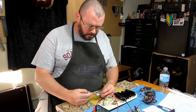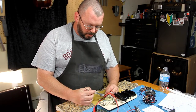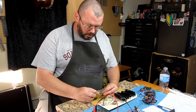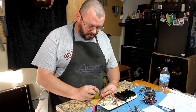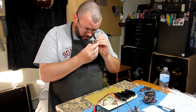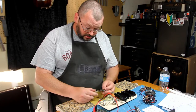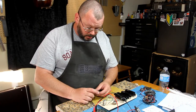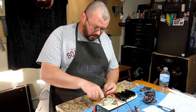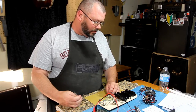Number one, I have got a bridge that basically goes from the pot and then the two middle lugs on the coil tap part, that I have to connect those three points. And then I have this little tiny, looks like a 23K resistor, and I've got to get that again between the casing and this far left lug, so I'm going to move those over to there, and then we'll start